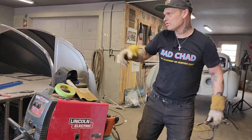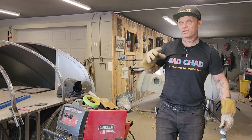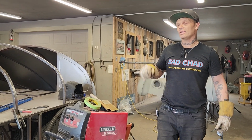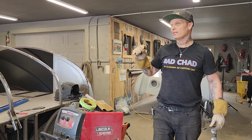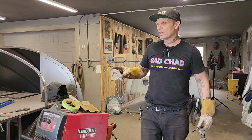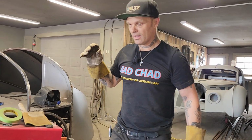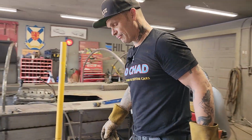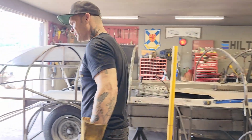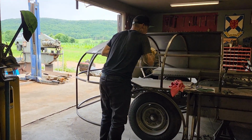Also, with the engine, I'm not going to go with the conspiracy of it starving the front bearings. It's not going to do that. It has an oil gallery from the oil pump to supply that bearing, and that's probably the way they made it, so it does not do that. And that's my story, and I'm sticking to it.